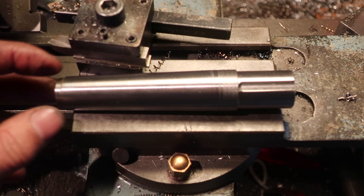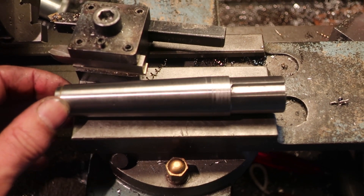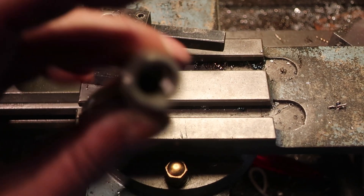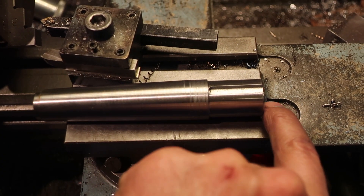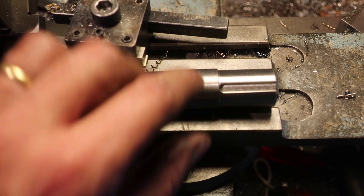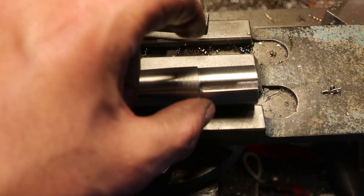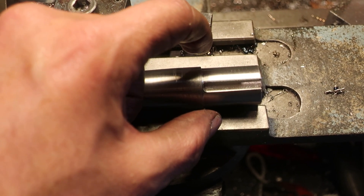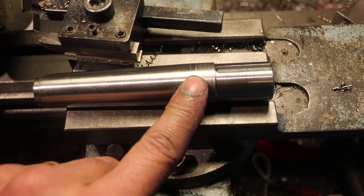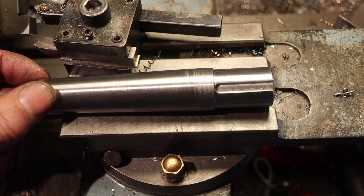And there we have it — one Morse 3. 22mm. It's keyed on this end, deburred. It's got our M12 drawbar thread in that end. We'll need an M10 thread in this end to hold things on. And away we are going. So basically what we need to make now is a little stepped piece, 22 to 35mm, with key slots in and out. And then we'll be able to do our gears.